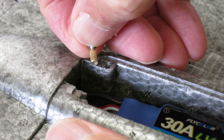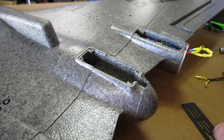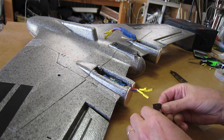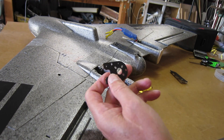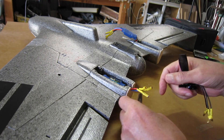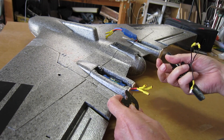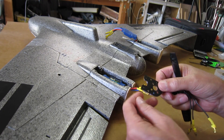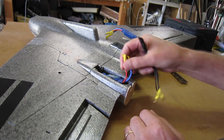After my CG testing, the motor mount showed how pathetic it is — that's another really dumb decision. Bolting the motor on through the back and then gluing that on means the motor is effectively glued in position. You can't remove the motor without ungluing it or just ripping it off, and it's just not a big enough area to hold the motor on anyway.